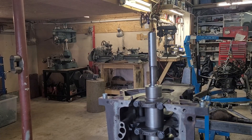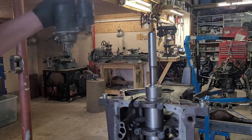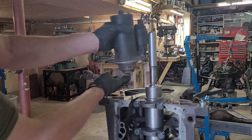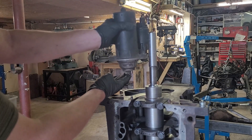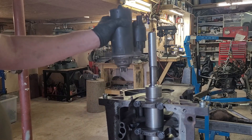Another thing to consider is the positioning of the starter — where are you going to mount it? Originally the TDI starter is mounted on the transmission side, so it's sitting mounted to the bell housing. That's out of the question with the 700R4 transmission.